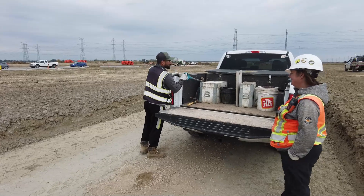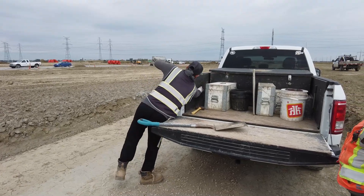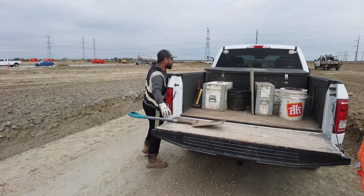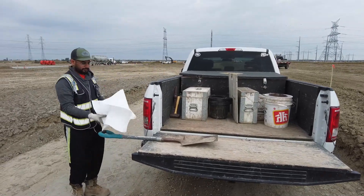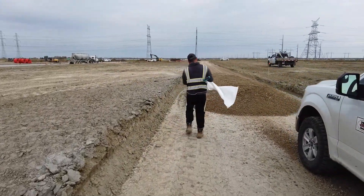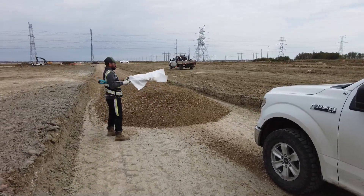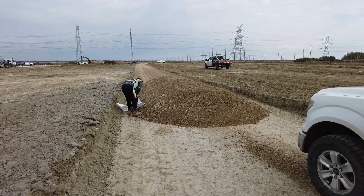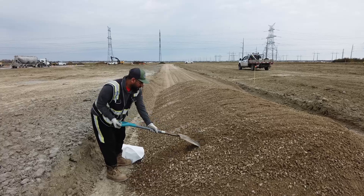About every 500 tons of gravel, or 15 truckloads, these guys will come and fill up a bag of gravel — a sample they take back to their lab and analyze. When you're operating a grader, it's something you have to watch out for, because every couple of hours they'll come right in where you're working to pick up this sample. You might have to gouge your blade into the compacted material and create a little windrow for them so they can pick up a good representation of the material.